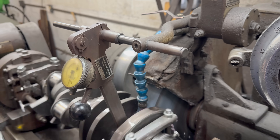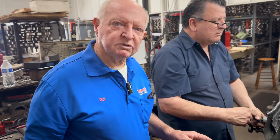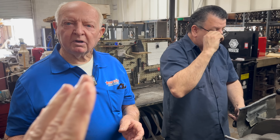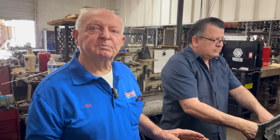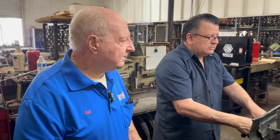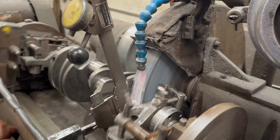This machine is so technical. He'll probably be the last thousandth or so where he'll actually manually push the stone into the crank. So he's just touching it basically. If I cranked the wheel, it'd be 50 under by the time I got done. He'll just push it in there the last bit, make it exactly right. It takes a lot of skill.